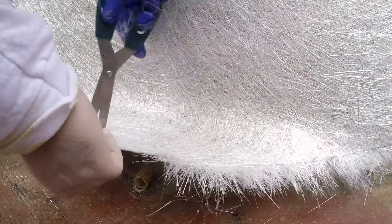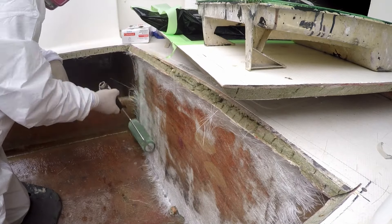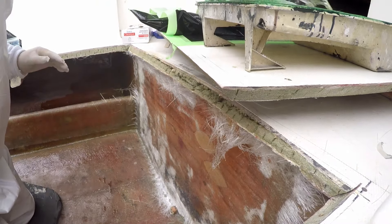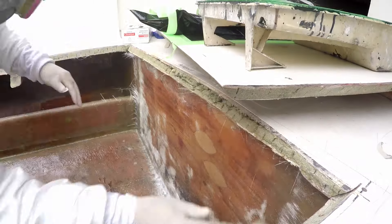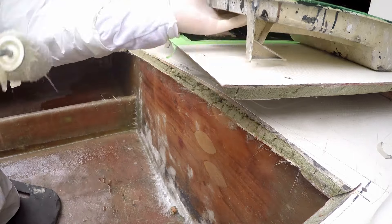There's no way that I can manage a wet CSM layer of this size, so I decide on a dry layup. The large sleeve holds a lot of resin, and the exothermic reaction released so much heat that it cooked the large sleeve. So it's back to the 3-inch roller. And the fumes are off the charts — I swear I can taste the resin through my eyeballs.